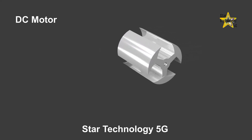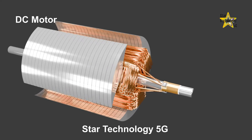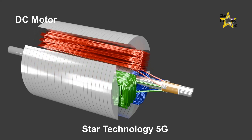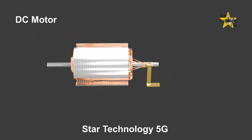The shaft is attached to the armature. The armature has a set of armature windings, wound on the segments of the armature. These windings are attached to the segments of the commutator. The commutator consists of small copper plates mounted to the shaft. Each plate is electrically isolated from one another as well as from the shaft. The end of each coil is connected to a different commutator plate. In this design, each commutator plate is connected with two coils. When brushes rub against the commutator plates, these plates deliver electricity to the coils to complete the circuit.